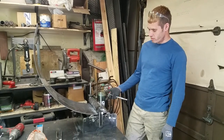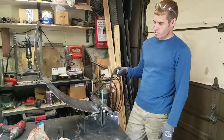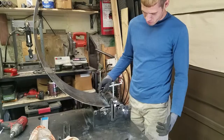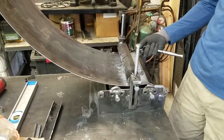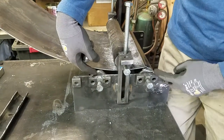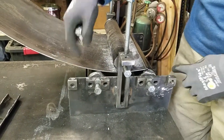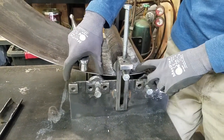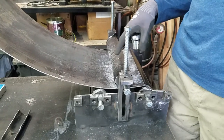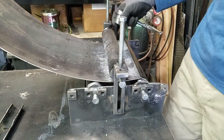Here I am with the super heavy-duty steel slip roller — heavier-duty than even the regular one I make. This is my prototype version, which will be for sale very shortly. There are adjustable positions for the lower rollers so you can spread them out substantially, which allows your bending distance to be much larger. This thing could probably roll 3/8 sheet in smaller sections, but I haven't even tested it to that capacity.